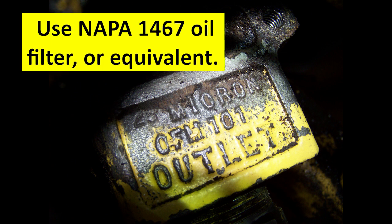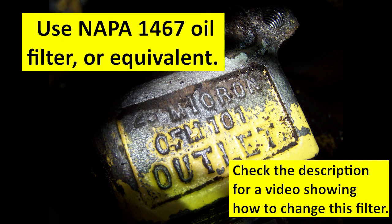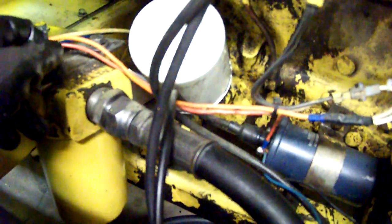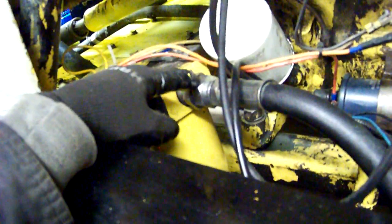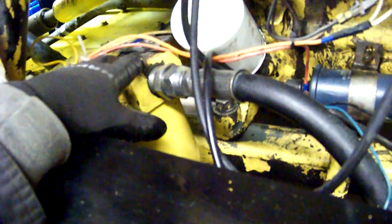This manifold has flow to the drain via that check valve, or flow from here through a hose that runs to the oil filter. That hose comes in here to the oil filter, which is a 25-micron minimum oil filter. Oil comes out of the oil filter, so now we're downstream of the most serious filter on the system — there are really only two: one is just a screen, the other is the actual filter. I mention this because if you're replacing any components downstream of here, any contamination you don't clean will remain in the system.